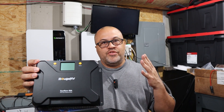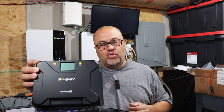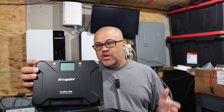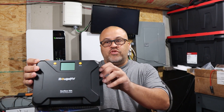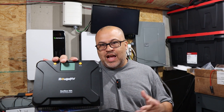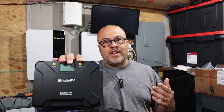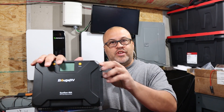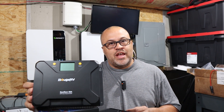So what can you do with a system like this? It's great for smaller setups. If you're running a couple of 12-volt 100Ah batteries, this can handle charging them — you should be able to pull in around 3 kilowatt-hours a day. If you're running a refrigerator, lights, or some backup power for your house, this can manage it. That's what we'll be doing in upcoming videos, using this on those project builds. If you have any questions or comments, let me know below, and if you like this kind of video, hit subscribe and like — thanks for watching.